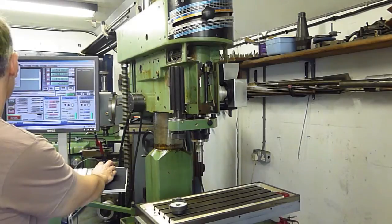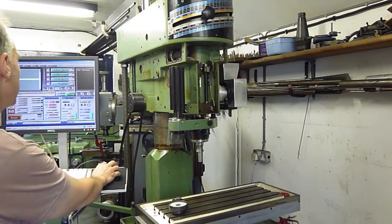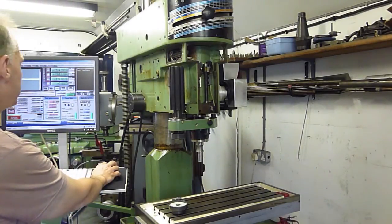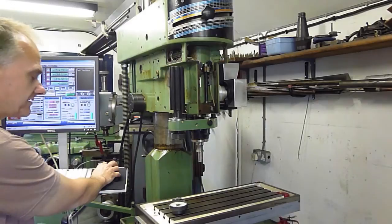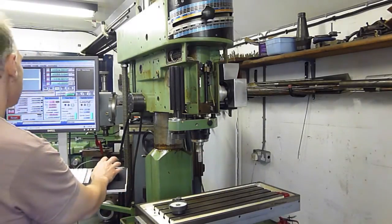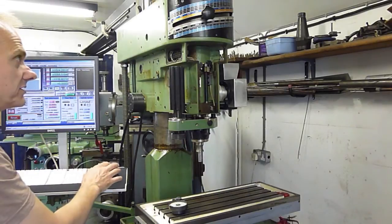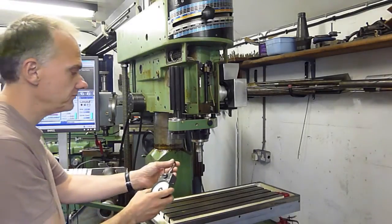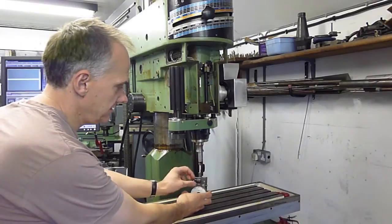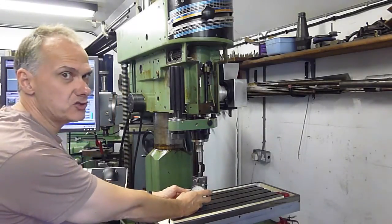Just making sure we are actually on the lowest speed setting. This will actually be running at its maximum speed from that lowest speed of the motor. It will be running at 100hz in that motor, so 900rpm from the motor, which will give double the spindle speed here. Yeah, that's about 1350rpm.